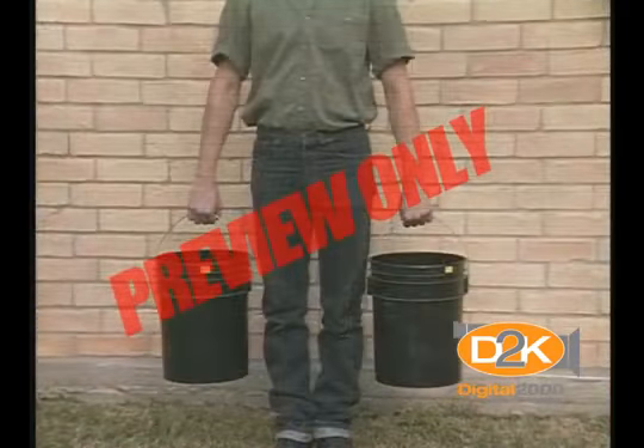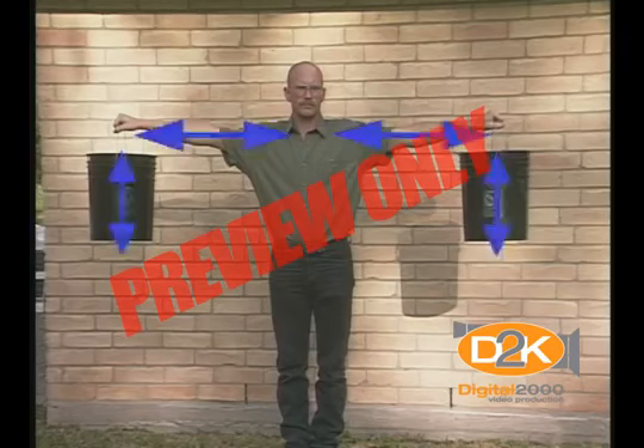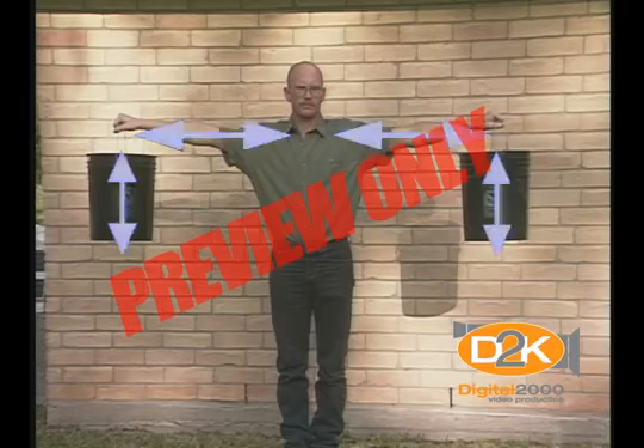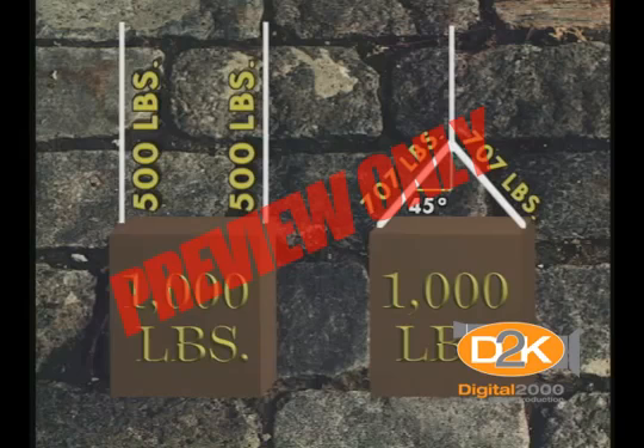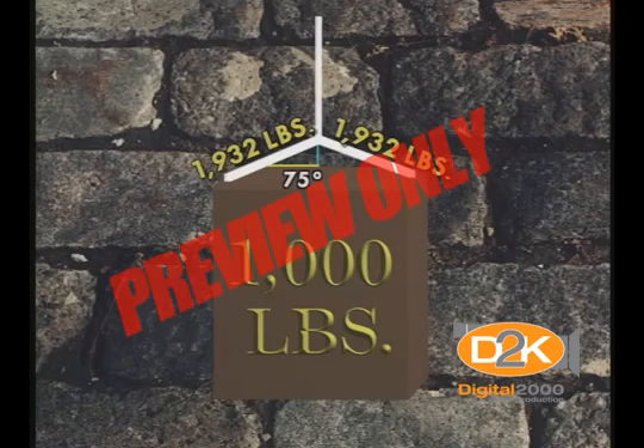The best example is a person lifting two buckets of sand — both arms lifting vertical to the load, with stress transmitted straight down. If you place your arms at the horizontal, stress is applied downward from the weight of the load and also horizontally, creating two forces of stress. Each of these slings is lifting a 1,000-pound load. The two vertical sling legs have 500 pounds of stress on each leg. At a 45-degree angle from the vertical, each leg carries 707 pounds. At a 60-degree angle, each leg has 1,000 pounds of stress. The far-right sling has over 1,900 pounds of stress on each leg because its angle is so far from the vertical.